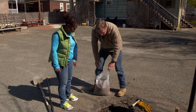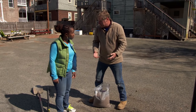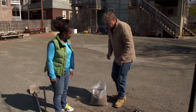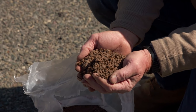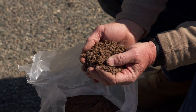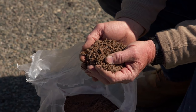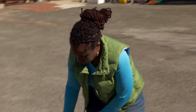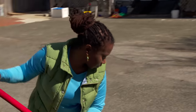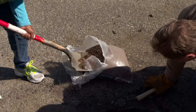All the material we dug out, we're not going to use again. I want to make sure this isn't going to settle. What I'm going to use is what I usually use underneath a walk or a patio — it's called pack. It's made up of stone dust and an aggregate stone, and this pack's hard as a rock, so it will never settle. The first thing I want to do is push some pack into the pipe to fill it so nothing will leak out of here again.